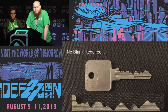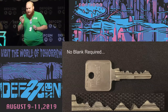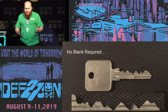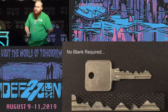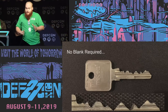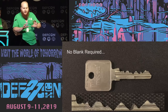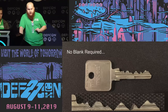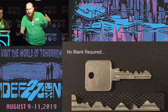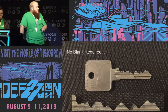You don't necessarily even need the blank. So high security lock manufacturers tightly control the blanks because the blank can be used to create any key. Once it's a cut key, it goes to the end user and they can lose it, sell it, whatever with it, and it's completely uncontrolled. So if you can get a cut key that happens to be the same keyway and possibly has other similar security features as the key you're trying to duplicate, you can cut it down where it's higher than the key you're trying to duplicate, and where it's lower, you can just add metal to bring it up.